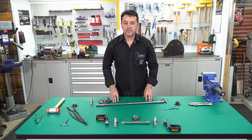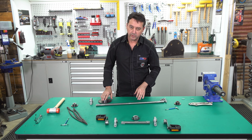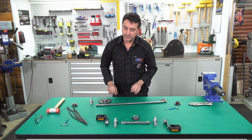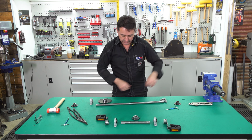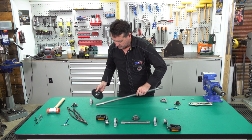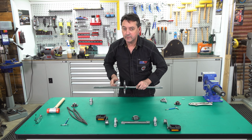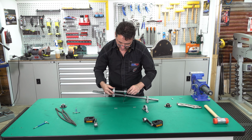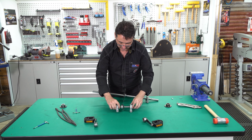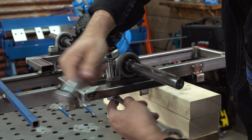We're going to do some pre-assembly work on our rear axle and our front crank. We're going to put the following sprocket on, but not tighten anything up. It'll make it easier as a unit with the bearing blocks to put on the chassis. So these are all keywayed. If you didn't do the keyway and you've just done the grub screw method, just nip it up, but bear in mind later on we'll do some alignment work, so don't over tighten it.